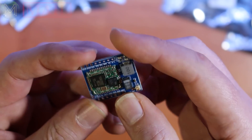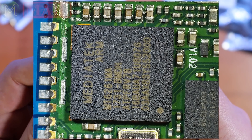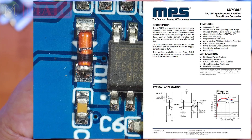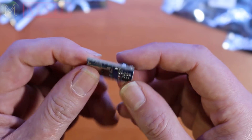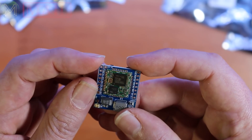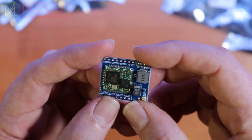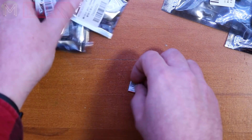I've managed to pull the can off the top and the main SOC is actually an MT6261MA — I can't really see much difference between the 6260 and the 6261, maybe just a slightly different clock rate. On the back, this IC appears to be an MP1482DS from Monolithic Power Systems, a simple DC step-down switching regulator, there for pulling the 5V supply down to the 4V required for the module. On the top side there's a GSM GPRS RF transceiver. Bang for your buck is still pretty good considering you get all those extra features like Bluetooth. It'd be good to hack around with this, but I'm going to put it on the back burner — I've got a whole ton of other projects to look at.